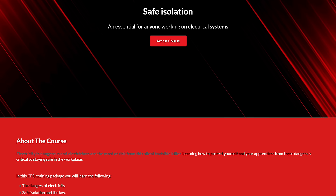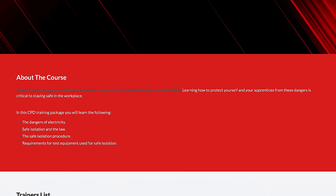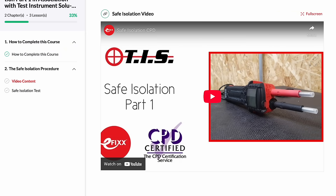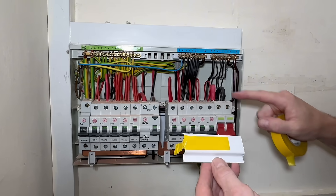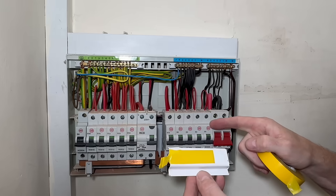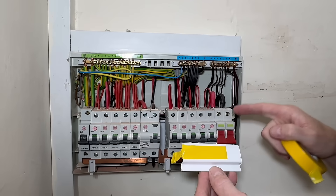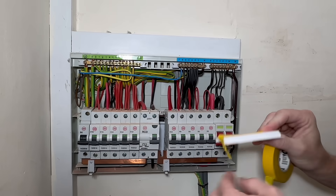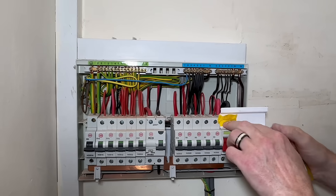If you want additional instructions on safe isolation, I've left two video links for free CPDs in the description. What I normally do is put a piece of sticky mini trunking across the live connections — I haven't got any at the minute so I've got a piece of capping — because when I'm checking screws for the required torque setting I don't want to accidentally touch the two that are live. So I've got a bit of insulating tape to stick across them and bring that into position.